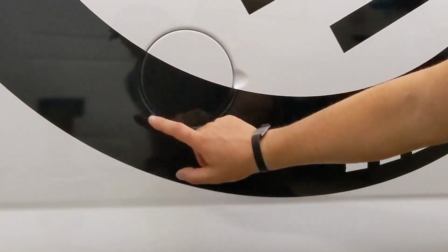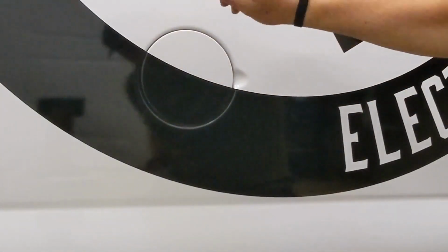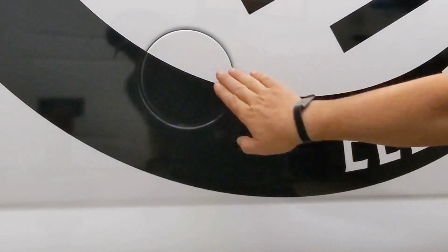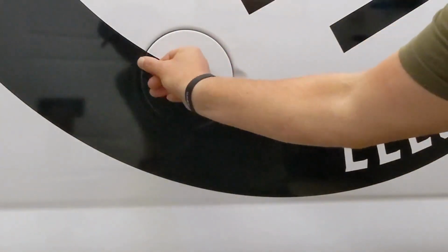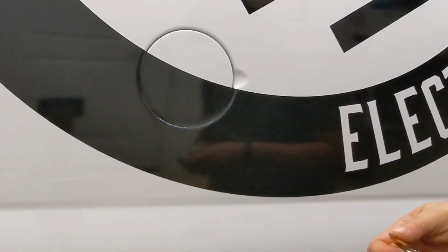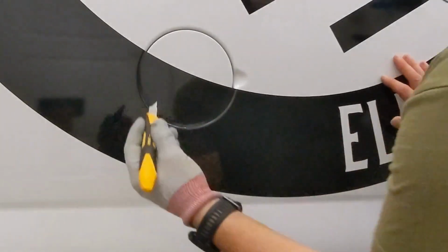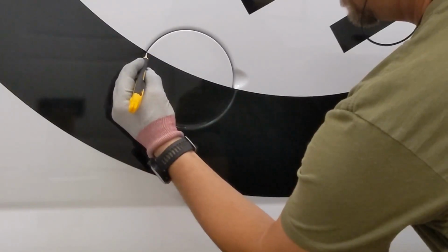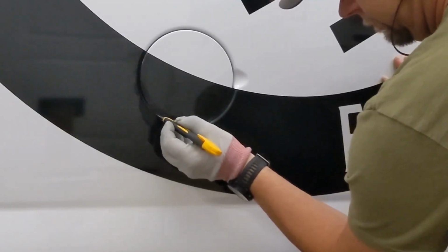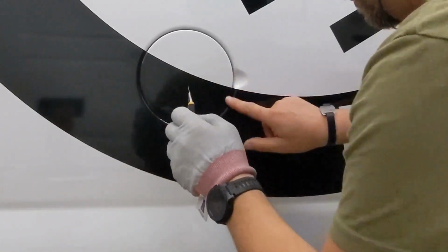Okay, now this area takes either one cut or two cut. You can cut against this side or you can cut against this side. One, two. Or what I like to do is cut against this cap and tuck this outside edge in. So let's do that. We want to make sure we push all that vinyl in as far as we can. Fresh new blade, clean cut. Don't expose your blade too far. So now we're going to go this way.